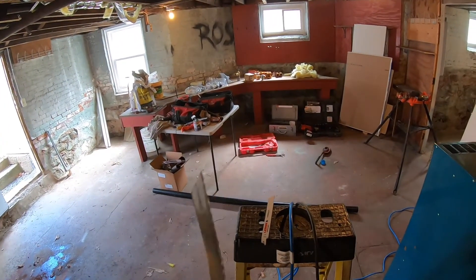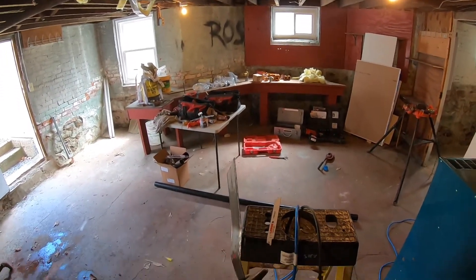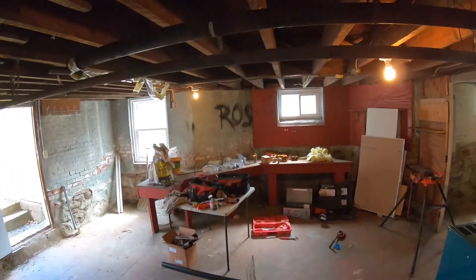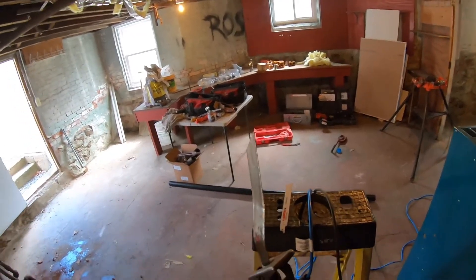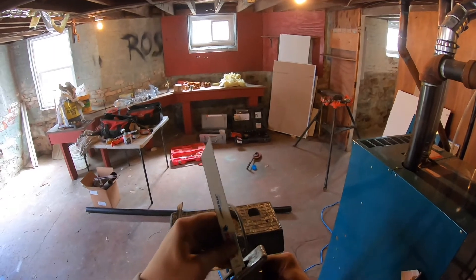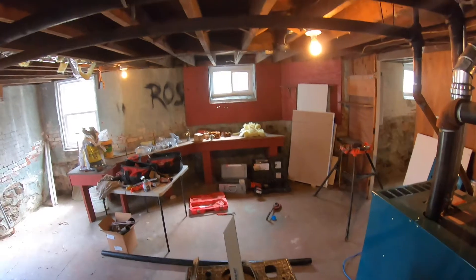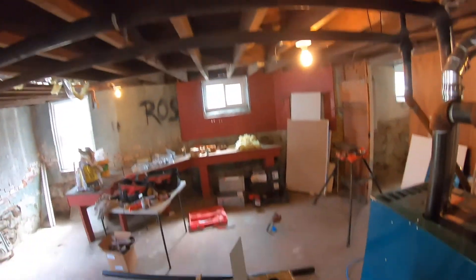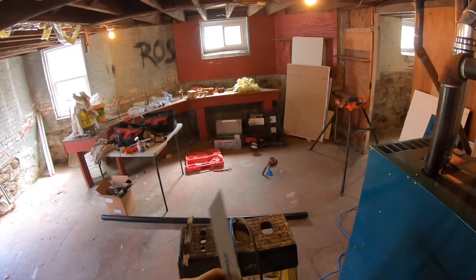When using a Sawzall and the blade bends or breaks, you're probably putting way too much pressure on that blade — it's probably getting dull. You never want to have to put too much force on a power tool, whether it be a drill or a Sawzall. So I'm just going to get rid of this Sawzall blade and put in a new one. The power tool should do most of the work; you should never have to overload it. I unplugged the Sawzall before changing the blade. Make sure that the chuck holds the Sawzall blade tight, because you don't want to ever put that Sawzall up onto the workpiece without it being properly installed.